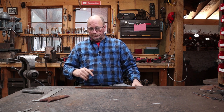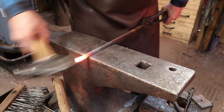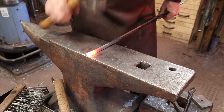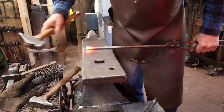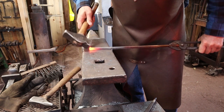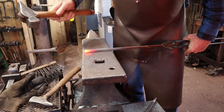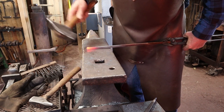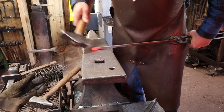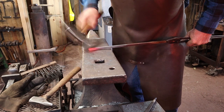I'm going to get the forge hot. I'm working in the gas forge, so I'm going to let it run so it maintains welding heat — you'll just have to listen to the narration over the roar of the forge. I'm going to start by upsetting this end just a little bit, working the corners down to keep the upset more centered.